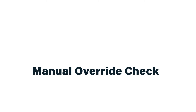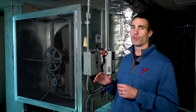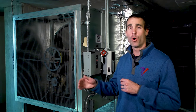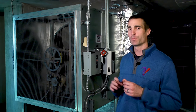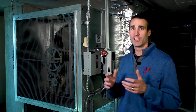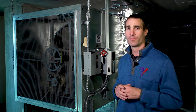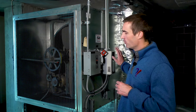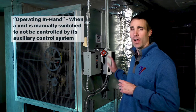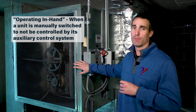Finally, it's important that you walk around your facility and look at individual pieces of equipment to make sure they're not manually overridden on or off. For example, here's an exhaust fan in an enclosed parking garage that meets the ventilation requirements — it should only run when the carbon monoxide detector tells it to. If you walk up to this exhaust fan's VFD and find it in hand or off rather than in auto, that's probably an indication it has not been operating properly.